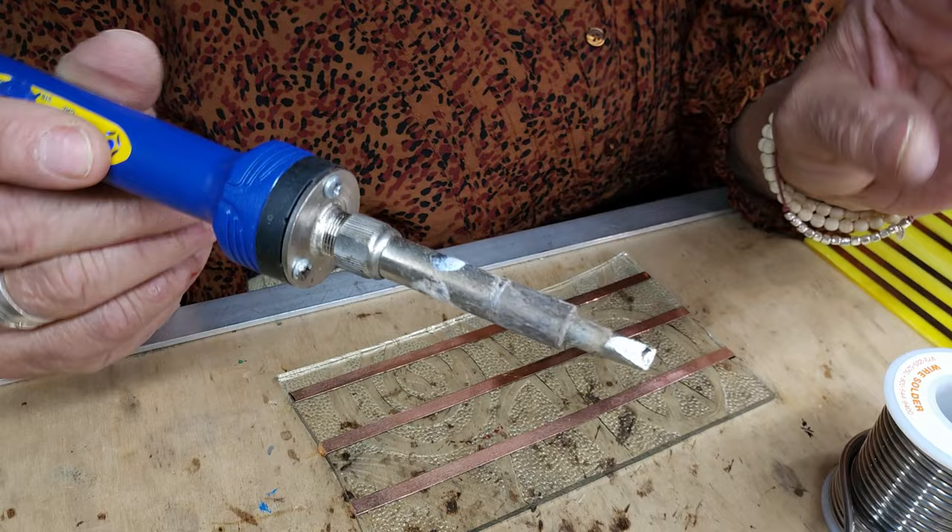So we got two nice lines going here. Got a sponge here that I'm using. Take a little bit of my flux. I don't get my tip of my iron in there. I'm going to tin this here just like this. This is what tinning is called. I do a lot of tinning on stuff before I do decorative solder. You don't need to make a big raised line to do decorative solder. You're just going to lay a small line there to get you going.